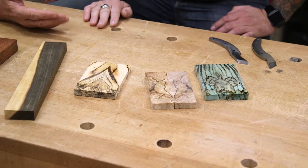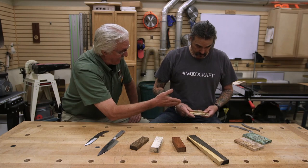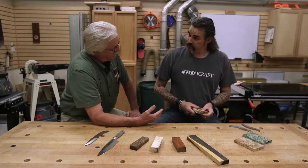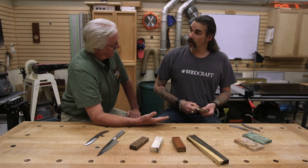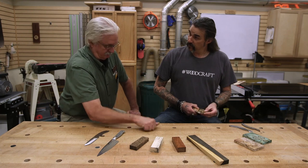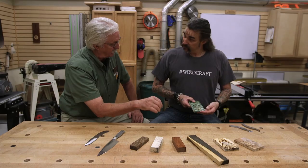If you were going to use it outdoors or in a hunting situation where it was wet all the time, that won't warp like normal wood. Stabilized means it's been baked in an oven or microwave and saturated with basically a super glue, which makes it virtually bombproof and waterproof because it's plastic. The dye goes all the way through — if you cut or sand, no matter what you do, it's that color green all the way through.